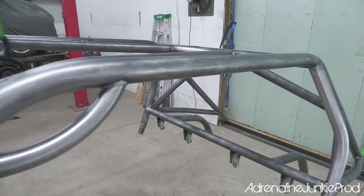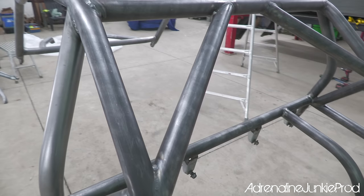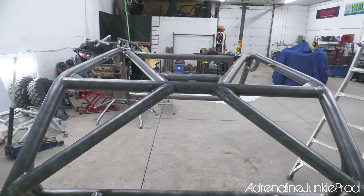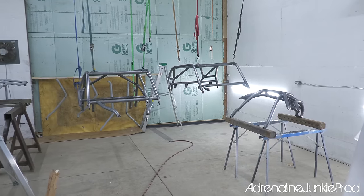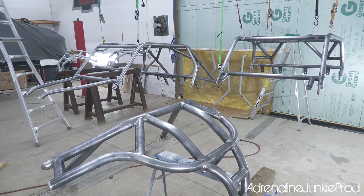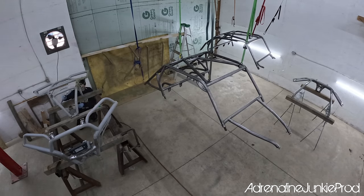It needs a really, really big oven. Usually you can't powder coat on your own. You can pull this off. You can paint inside the shop. We've set up like this little ghetto paint booth with an exhaust fan. You can even paint outside if you really want to, if the conditions are pretty good. In addition, touching things up using this urethane is a lot easier than trying to touch up flaking powder coat. And urethane is basically like a liquid plastic, so it gives you a really, really strong and durable finish.